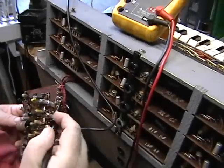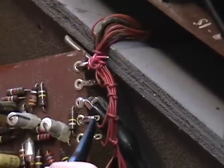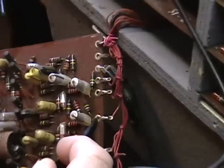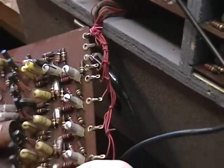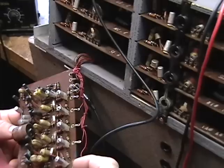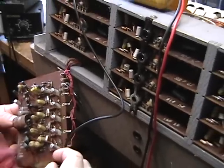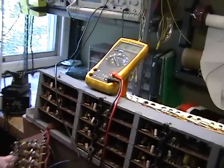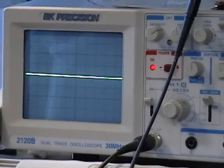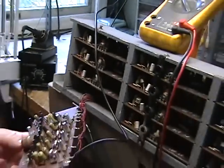We've got the scope. This is ground on this pin, and these are some voltages — this is the output of the dividers. Each one should be progressively lower, and so far that is the case. All the dividers on this particular card are running, although they're running rather crudely. That's the F sharp card. There is one card for each of the 12 notes in the octave, and the frequency increases every time by a factor of two. This particular one has all of its dividers running.